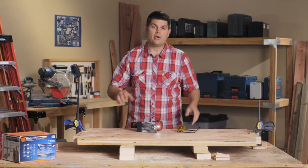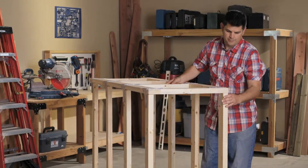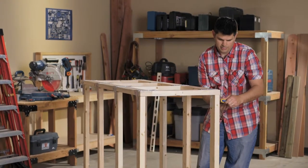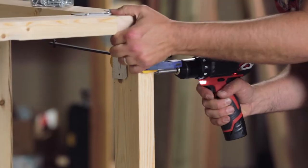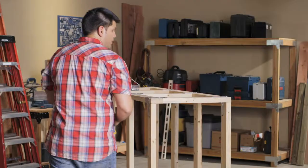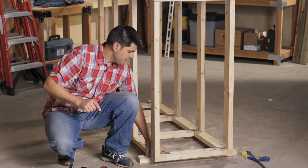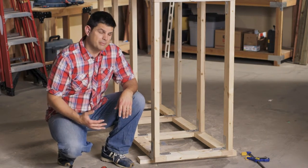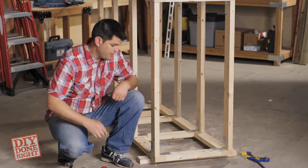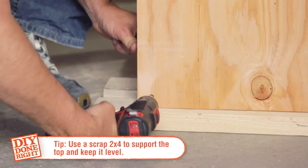Now that the shelves are done, we're going to move to assembling the frame down on the floor. With our other end on, we're going to clamp these and screw all of the connectors to our frame. This is an ideal time, since it's on the floor, to add the top shelf. I have this on sleepers — basically scrap 2x4 — because once everything is assembled the unit is going to be a little heavy. To make the top shelf line up, I'll take another scrap of 2x4, put it underneath, and that way everything lines up so I can set the shelf on, screw it up, and then put it upright.